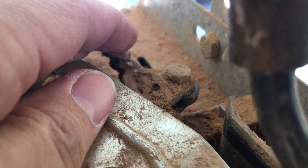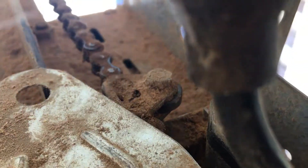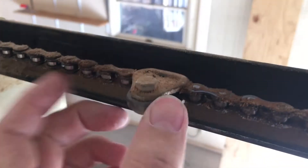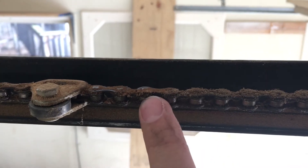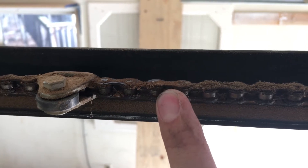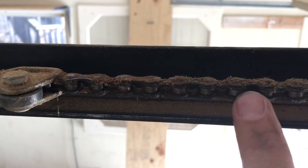So if I move this roller out a little and let it pull the door up more, that will solve my issue. I'll lower the door to give you a better view of this roller attached to the chain. My thinking is we move the roller down — I'm going to move it down about two chain lengths to start, and see if that helps. Then I'll continue moving down if needed.